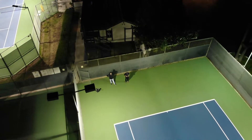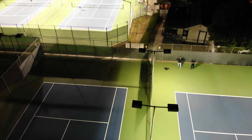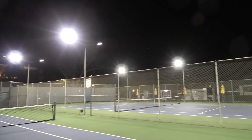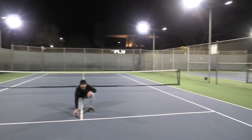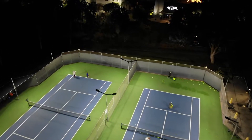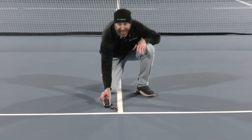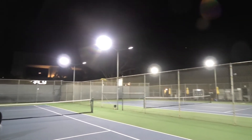Just really not very good lighting on this court compared to what we're going to see with the new Next Gens. Now we are here on the courts with the brand new 500-watt Next Gen 3s. We've got six of those here, as opposed to the eight 1000-watt metal halides on the previous old court. We're seeing about 330 lux, still about 313-314 lux with a couple of shadows near me — so a little over 30 foot candles. That's about a 50% increase with these six Next Gen 3 lights versus the old metal halides.